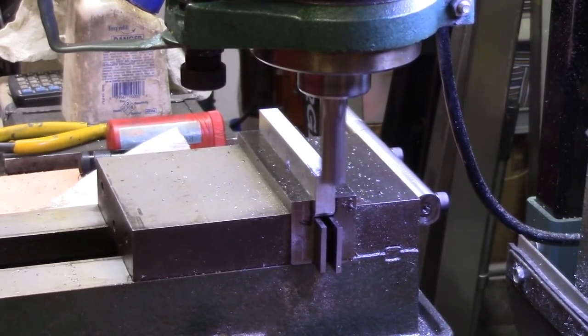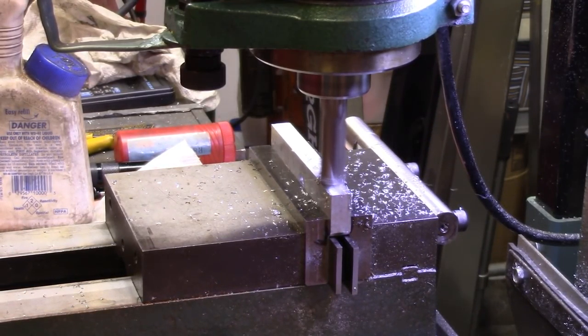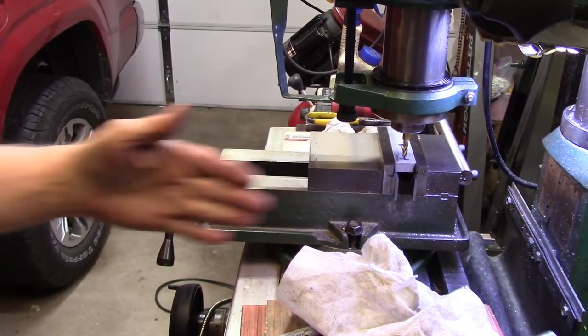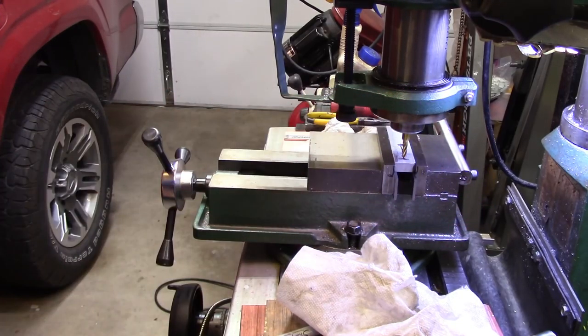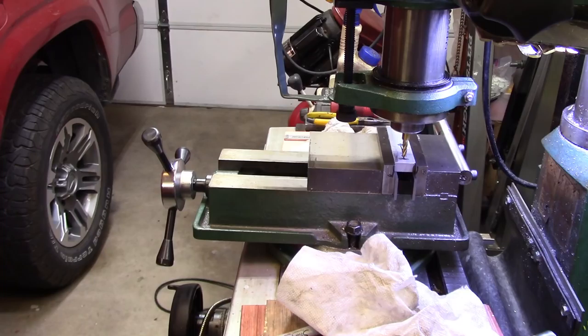I'm going to find the metal to make the next piece. This finished product won't be as nice looking as something that a guy sat down and purchased exactly the right metals for. I'm using whatever I've got laying around — an old bent stainless rod that had been pounded on severely, with mushroomed ends and a bend in it. I'm going to make this next piece with a piece of aluminum that Chuck Bomarito gave me. I've got to kind of square it up, then take it to the belt sander and round it up. The next step is to put a quarter inch slot in this so I can move it back and forth on the little bar in the back, which gives me added adjustment. I'll make that slot up to about the hole that's already in it.